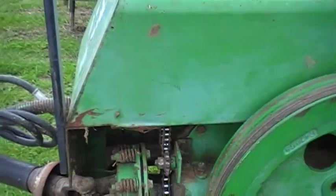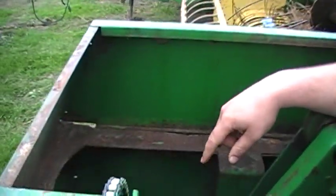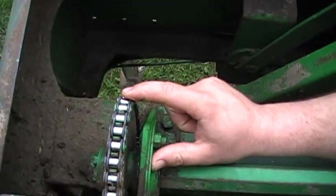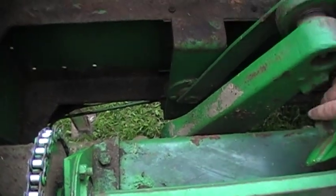Lift up the cover. Look at your top drive sprocket — make sure the teeth look good on the top. Check your bearings and your plunger stop.